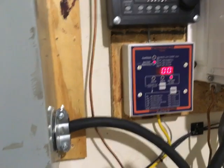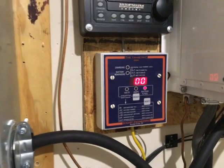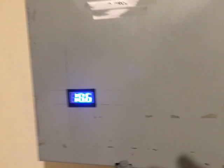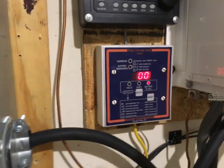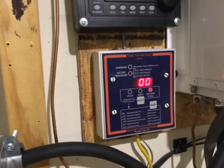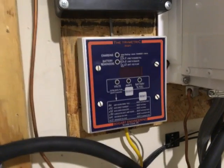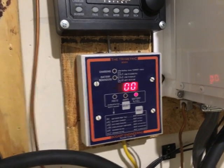I'm really excited about that. The problem at the time was my refrigerator and freezer were kicking on and I was getting premature shutdowns. So I explored the idea of an ultra capacitor bank, and it works just like I wanted it to. With Phillip's help — pointing out that the AC capacitor was consuming power — the numbers from the kilowatt meter proved it and that saved me an additional 15% capacity.